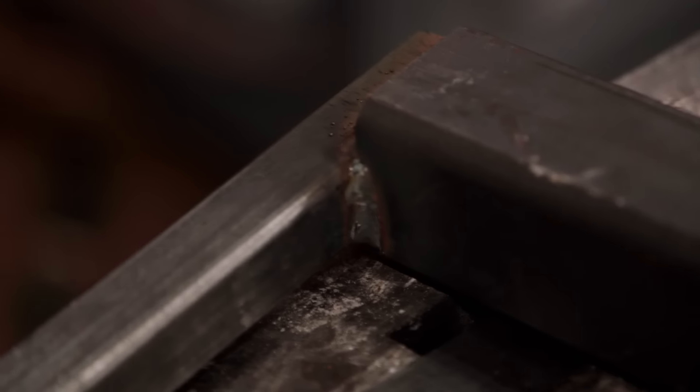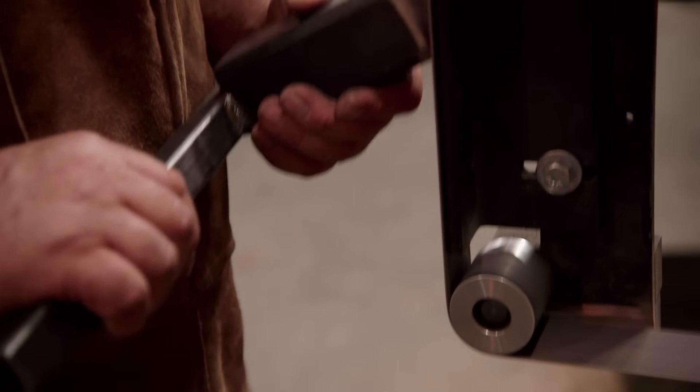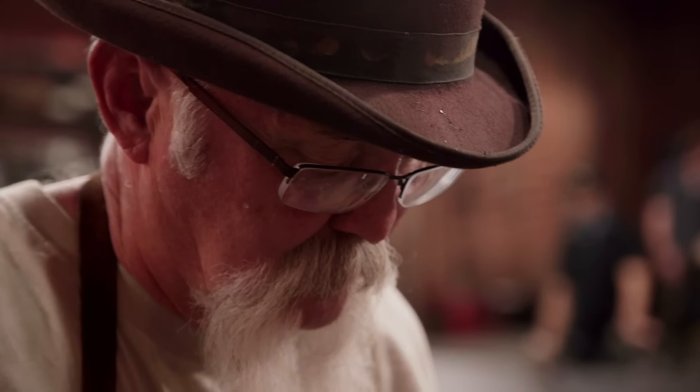Looking at Frank's hammer, he's got the handle all the way in the back — you see that style on Sawyer's hammers, a Japanese-style blade-smithing hammer. I use that type of hammer only for blade finishing. The forward weight and flat face on that hammer make it ideal for smoothing out steel. That may be his intention.